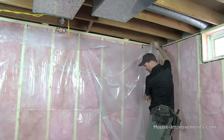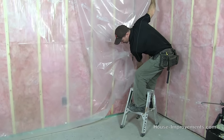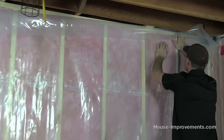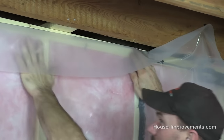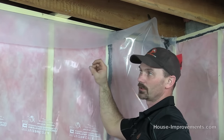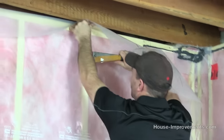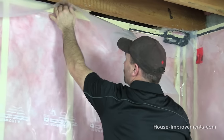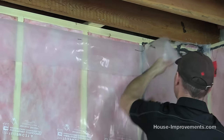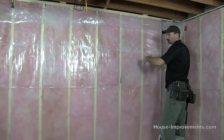Just let it drape down and get it around the ladder. These marks run along the top plate so I have a lip to work with. One thing you want to do when you staple — initially don't staple right where you're going to apply acoustical. Try to keep your staples down a bit so you can pull the poly down, run your bead of acoustical, then pull the poly up, smear it into the acoustical, and staple it in place. If you staple it up high first, you're trying to peel down that little edge and you're just going to have a mess. So you can see I've given myself a flap to work with. Once you have the poly started, you can keep yourself straight by just letting it hang without wrinkles.